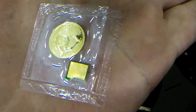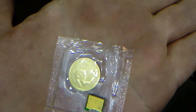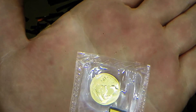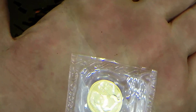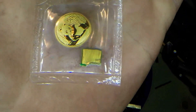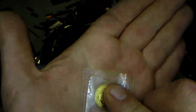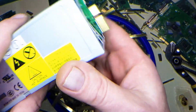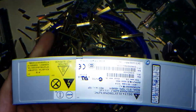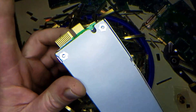In other cases you can get what looks like gold plating but it's not actually gold plating — it can be just gold flashing. In that case it still looks gold, but when you go to recover it you won't get the weight of real gold plating — it's just flashing. In this case it's gold plating and quite nice. That's off these old broken down power supply units from servers.